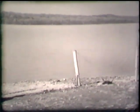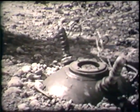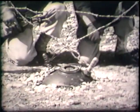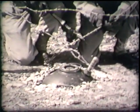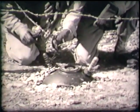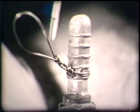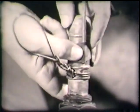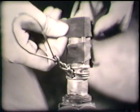The beach mine may be used as an underwater obstacle or land mine. Here it's employed in a barbed wire entanglement. Vehicles or men running into the wire exert a pull on it, breaking the lead horn and setting off the mine. Since water and sand can get in the switch, causing the mine to be armed even though the safety fork is in place, it's best not to disarm this beach mine. Instead, first cut the wire so the mine won't accidentally explode while working on it, then tape a blasting cap to the horn and destroy the mine. These can also be booby-trapped on the inside, so don't fool around with them unless there's no other choice. Take cover at least 200 yards away and let her blow.